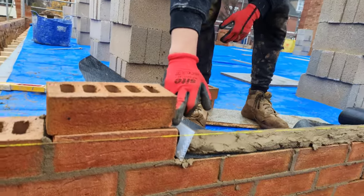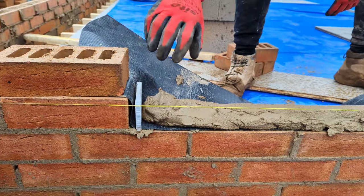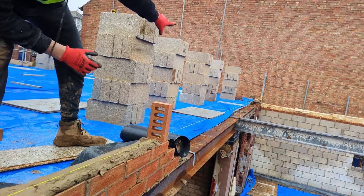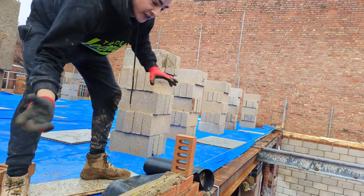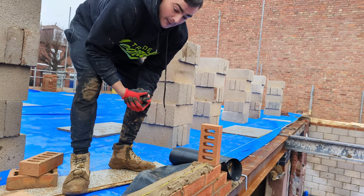So this is why we put a tray on. As you can see, I've got my upstand sorted and I've got my first weep hole ready to go. This tray is going to go across the entire length of these steels continuously, just to protect against any moisture getting into the building.